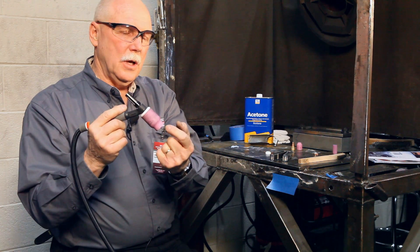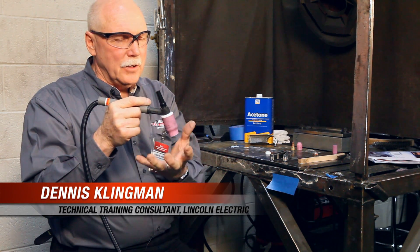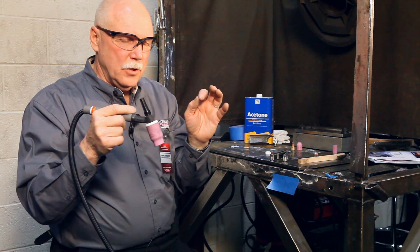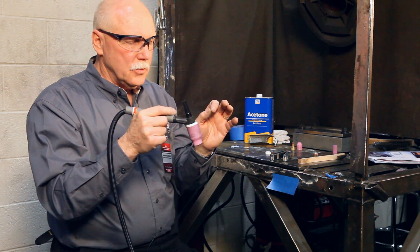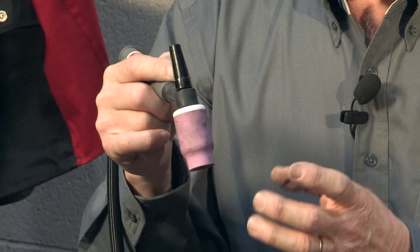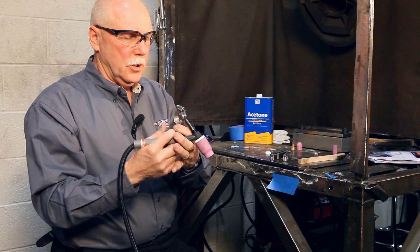With this large lens, it allows you to move maybe a little further — three-quarters of an inch — before you leave the gas shielding coming out of this torch. If you want to make a continuous weld, instead of making these little short welds and letting the material cool between each one so your weld doesn't leave the gas shielding at elevated temperatures, we have trailing purge kits.